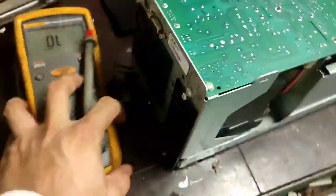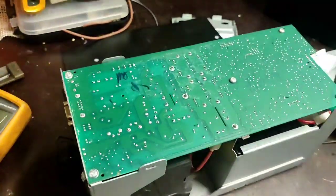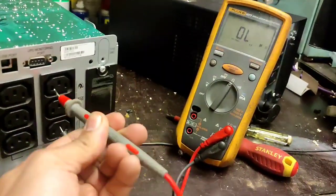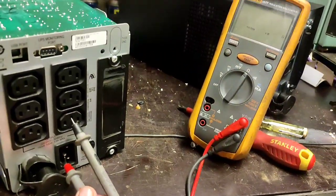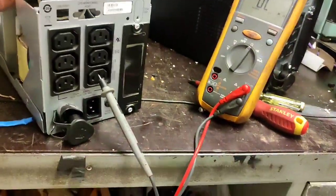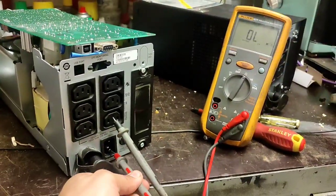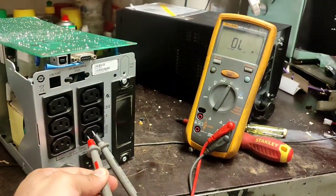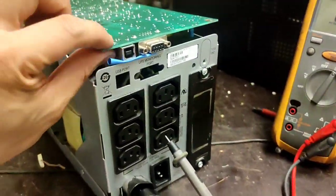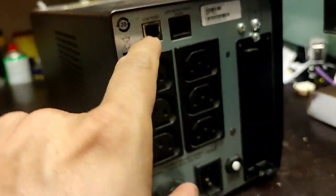I need to remove the securing bolts of the PCB. There is a ground on the PCB — one line has a 2 meg reading on that PCB. The common problem is at the PCB of this UPS. Just remove the securing bolts. I hang it and check with the ohmmeter — there is no reading. It means line 2 for that PCB has leaked on that ground.